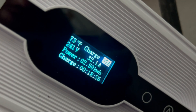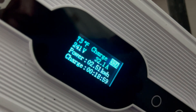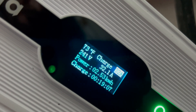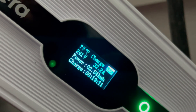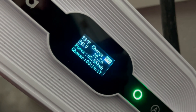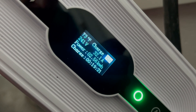We can see the line voltage at 241 volts, and in just about 19 minutes of operation we've added two and a half kilowatt hours — so it's operating at 7.2 kilowatts at 32 amps. I normally wouldn't recommend less expensive EV chargers, but this one from Terra has just been such a good value. It's often discounted, comes with a good warranty, and it's been really trouble-free to use.